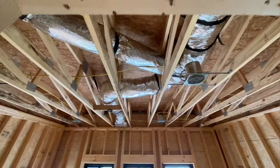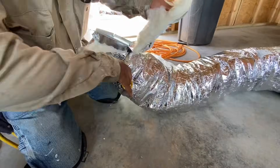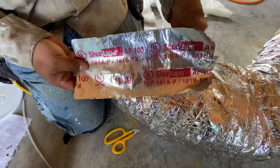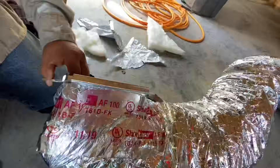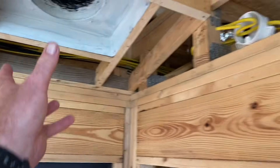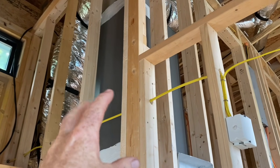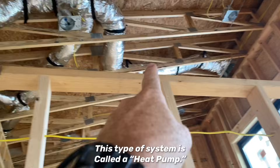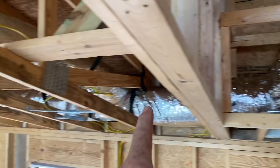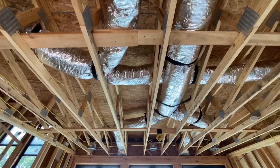I'm glad he's not stealing any of my tools this week. Let's finish this thing out by checking out the heat and air system in this home. Most of the supply and return lines in this home are made from this flexible insulated duct. Each duct is fitted with a boot at the end — which is the metal part you see here — and it is air-sealed at each end, then the duct will be put into place and it will accept a metal register on top of the finish surface. So here's how this thing works: we have an intake duct here and here, and those are called returns — they pull air into the bottom of this unit, which is the air handler. Then the air is heated or cooled over a set of coils that is connected to a condensing unit outside, and then it goes into the duct work — the supply lines — which go out and snake around into each room and through the truss area. It just recirculates the air and heats or cools it using an outside condenser.